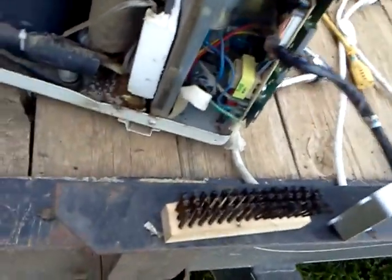Now, if you got an old one, or they still make them, the basic models with the turn knob, you can get away with that a little better, because those turn knobs don't really die, as long as you don't get the run capacitor wet, they're pretty well bulletproof. You can get the motors wet, all this stuff, because that gets moisture all the time. It's outdoors, but the electronics are on the inner side of the unit, which is indoors, which doesn't see the moisture, and that's why it's in these boxes, sealed off from the rest of the unit. Running the garden hose technique, you can still get a chance of water in there, and I'm not going to risk that.